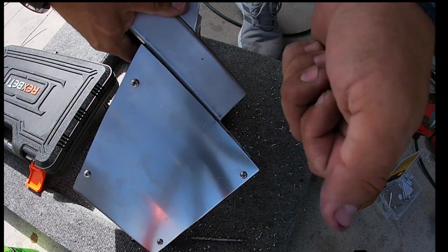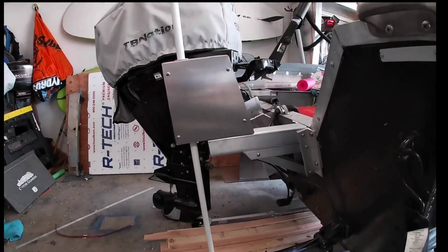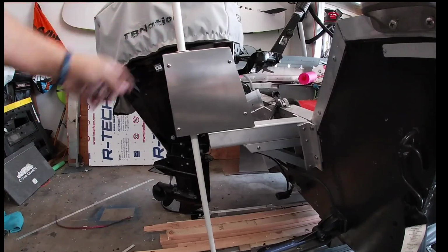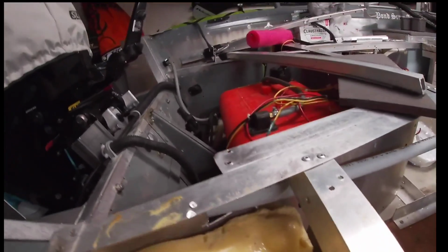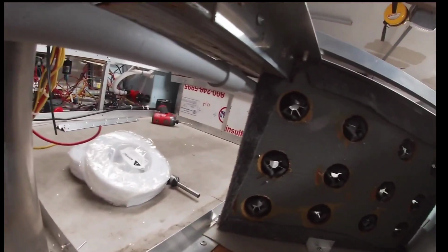All right, so it looks like this version is ready to be installed. We installed it right next to the jack plate, a few inches away, so the motor had full functional turn. This glides pretty flawlessly down the PVC. The cord pretty much has to have no sort of friction the entire way or the system jams up. So to make it as friction-free as possible, I ran the thinnest PVC piping that I could find.